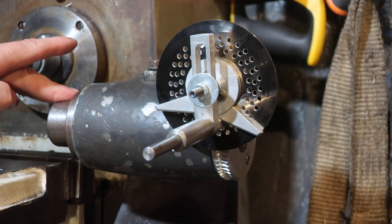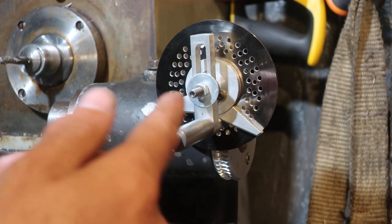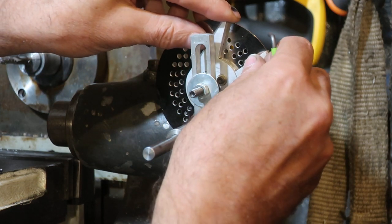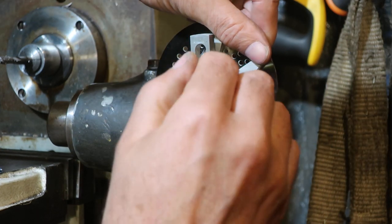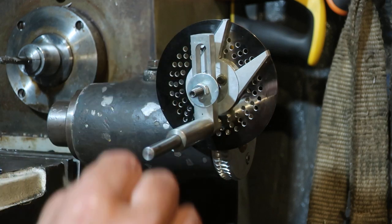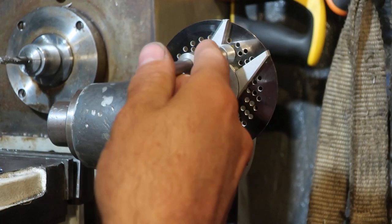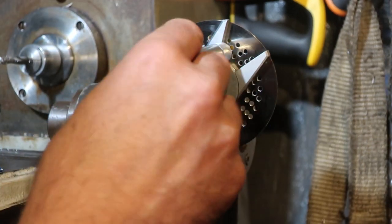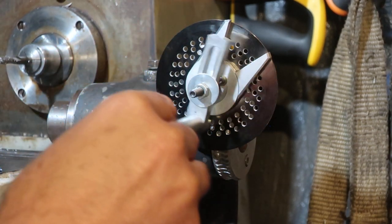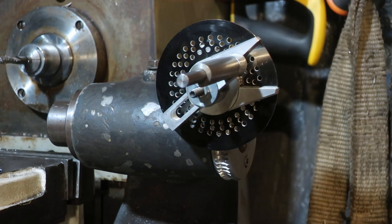To do 60 divisions here I need to do 22 holes out of 24. The way I'm going to do this is leave the extra holes — so we have three holes showing. Because if you were going round from here, you go all the way round and get to 22, 23, 24. So we want to stop at 22.